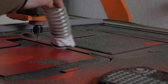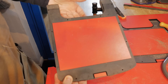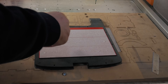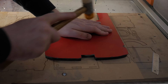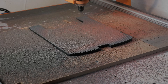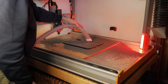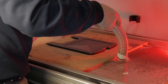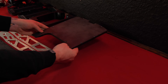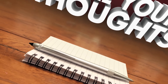That's why I went with it just for the prototype — now I know better for next time. Just like before, these parts need to be milled from both sides. To do that, I first machined a perfectly matching pocket into the waste board so I can fix the foot pads in place using tape and superglue. As you can see, HPL makes a huge mess, and the dust is definitely not something you want to breathe in. What material would you recommend for my next foot plates? Plywood? A fully 3D-printed version? And if so, what filament would you trust? Or maybe there's a material I haven't even considered yet — if you've got any ideas, I'd love to hear them.